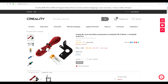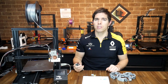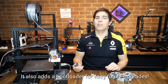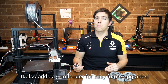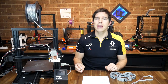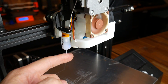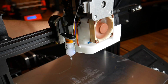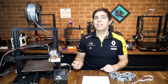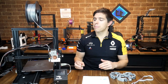For that reason I would only recommend buying this kit if you're going to use their software to flash a different hex file from a newer version of Marlin with all safety features enabled. You'll find a link in the description to a pre-compiled hex file you can use with the programmer as shown in this video — it'll have thermal runaway protection enabled as well as faster, more efficient probing. One final and very important note: this kit actually shipped with a BL Touch version 3, and as it stands with this printer that's incompatible. With all the same wiring and firmware it just doesn't trigger when coming down to home or probe the bed. I filmed all of this video with an existing BL Touch version 2 I had on hand. In my next video I plan to present a solution for those who have a BL Touch version 3 that's incompatible with their printer.